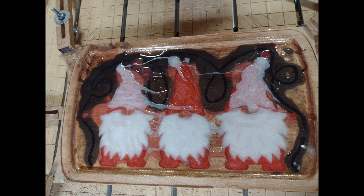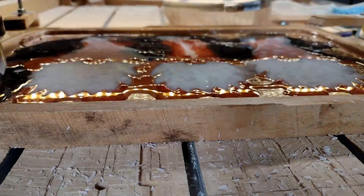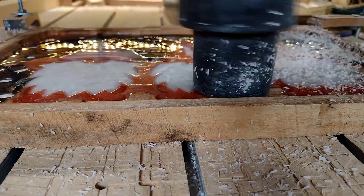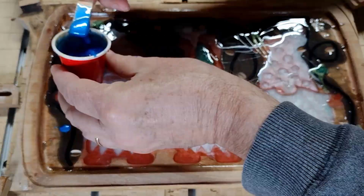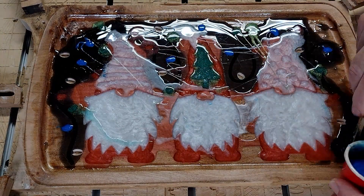I had some issues recording the carving and pouring of the white epoxy, so here's how it looks after that's all done. Once again I'm using my downcut 60-degree V-bit for the final three colors. Since there is no overlapping, I can do them all at once — first the green, being very careful not to spill anywhere else, then the blue, and finally the purple.